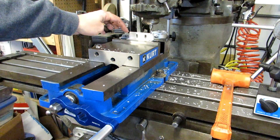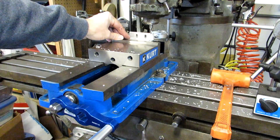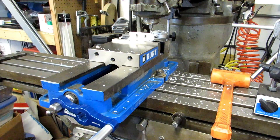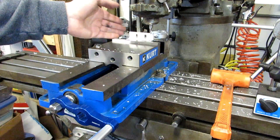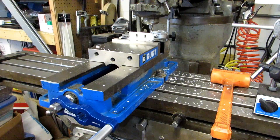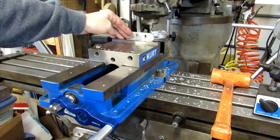One last thing I want to mention: if any of these were holes that were going to be tapped, you would really want to do each of the tapping operations at each hole before moving on to the next one. So you'd move to the first location, spot drill, drill, chamfer, and tap — then move on to the next one. If you spot drilled all the holes and then moved back to drill them all and then chamfered them all and then came back to tap them, you're introducing so many possibilities for errors that you're almost certainly going to make one. It'll be more tool changes but you'll have much more accurate results.